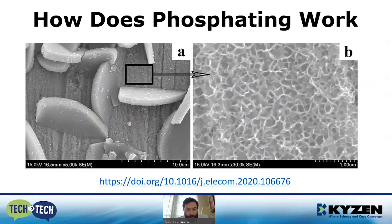The iron phosphate layer that you're depositing is actually porous — it's precipitating out onto the surface. We've got a couple of SEM images here. These crystals are forming on top of the iron phosphate layer on the left, but if we zoom in you can see a nice honeycomb pattern. That's really important because when you put a seal coat, rust inhibitor, or powder coat paint onto an iron phosphated part, it seeps into these pores and grabs on — latching in much better than it would on a smooth machined metal surface or a rough cast surface. This porosity helps with painting adhesion remarkably well.